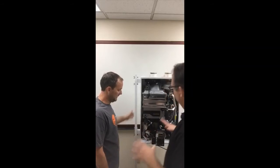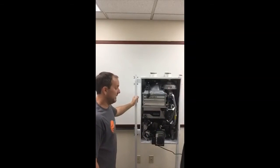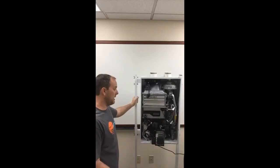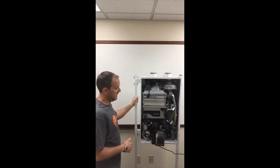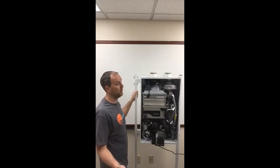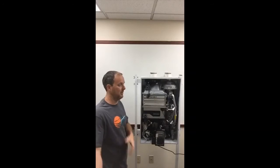So I'm just trying to look for the catch here, Ben. It must take a couple of days to install this thing. No, it's really a pretty quick process. And the nice thing is, like once again, we talked about the recirculation, we're easily retrofittable. It takes maybe 20 or 30 minutes underneath each sink that you decide to add the T underneath. And while we're there, we may end up replacing a few stops too, just out of maintenance and keeping the home safe and being able to isolate the sink faucets and other plumbing from the main system.